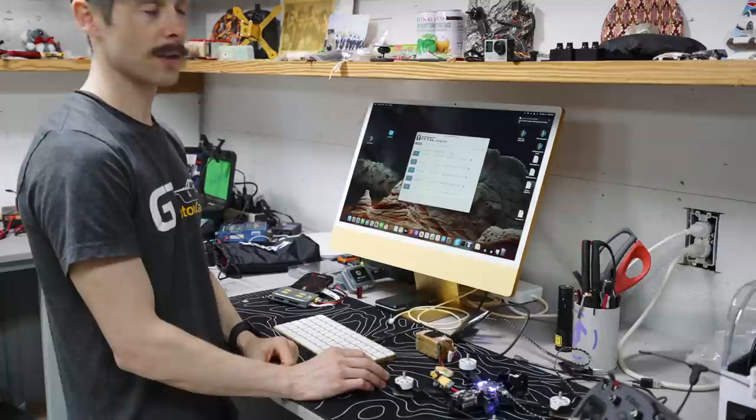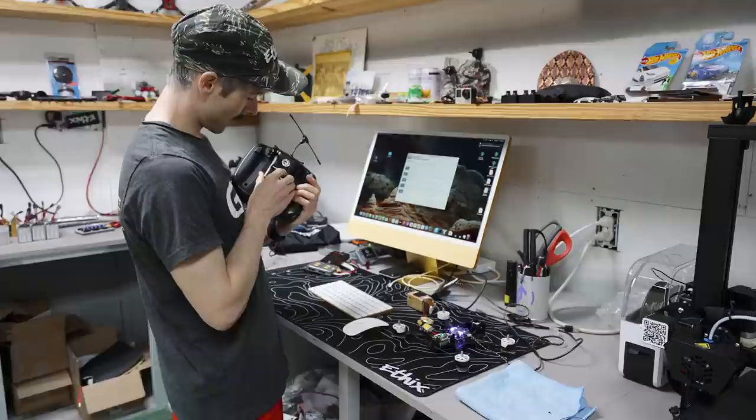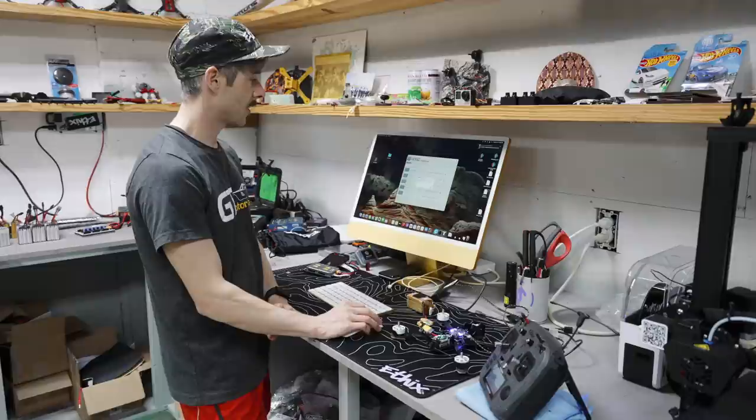Sorry, wow, 2020 came up a real long time ago and went away real fast. So now it's selected those ESCs and it's now flashing each individual ESC. And while it's doing that, I can just go ahead and go over here and bind my transmitter. So I've got this set up. It says, hey, you want to bind a micro TX? I say yes. It says, all right, we're going. So it's currently binding the micro TX, and the firmware for the ESCs is done.